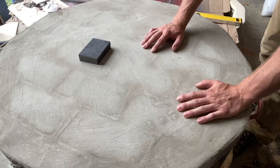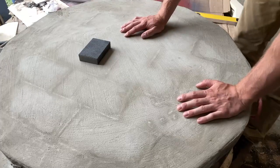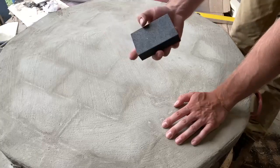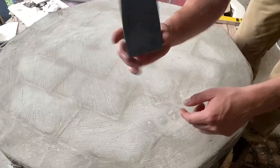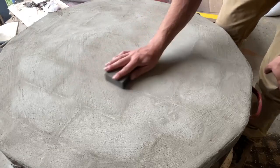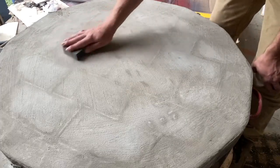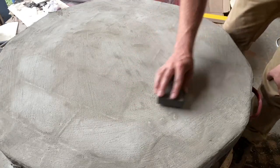Here we have a finished air-cured coat on the lid — it looks really good. I did lay it on pretty thick and it took some time to dry; this is day number four. There's some different coloration where the water soaked in a little unevenly. Now we're going to take a sanding block — you can get one at Dollar Tree practically — I take the heavier grit first and work from the inside of the lid doing small circles, feathering it out.